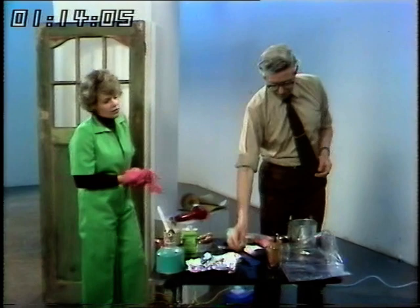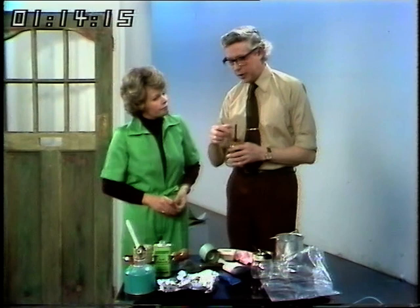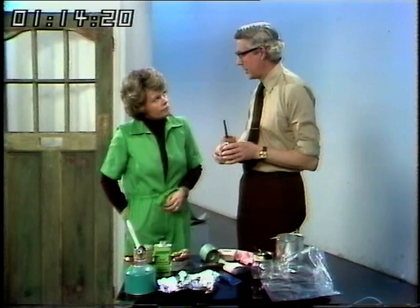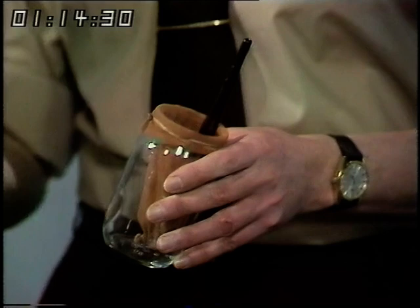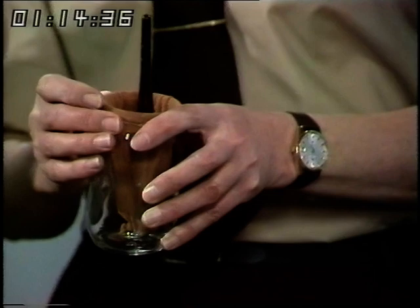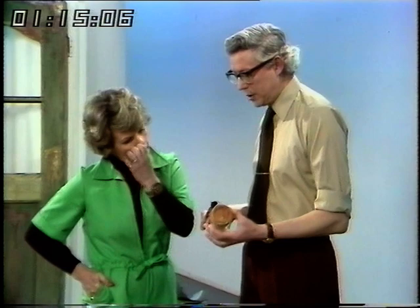You've got some useful tips over here. What do you do if you get a hair from the brush in your paint or any dust? If people aren't very experienced it's a good idea to use only a little paint so that if you contaminate it you can change it. But to pick out any bits without straining all the paint, fill your jam jar with paint, put a piece of tight or nylon stocking and fix it with an elastic band around the top, push it into the jar and pick your paint up through the stocking. It's wise to use a small jar — much easier to hold up a ladder than a litre can.